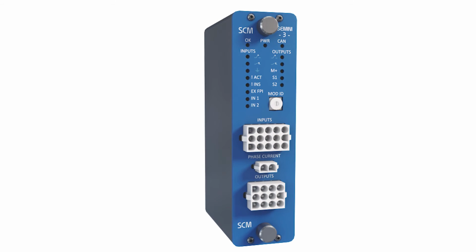The Switch Control Module, or SCM, provides the I/O to perform a secure control via the chosen protocol and has a mixture of digital inputs, analog inputs, and relay outputs. It can be used to trigger servo control inputs or supply monitored motor current directly in either polarity to a servo motor armature. One SCM should be fitted for each servo to be controlled.